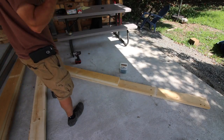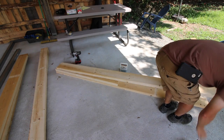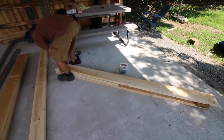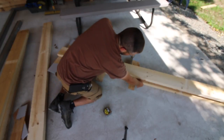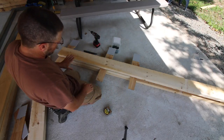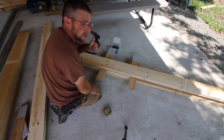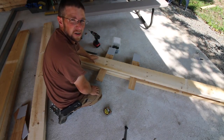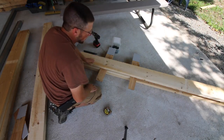Now that we got the first two screwed together, I'm gonna put the last one on top. I need a spacer — square everything up, flush it up. I had to shim these up. I want to make sure I have the right thickness in between here to get my glass panel to go through it. Now if they were all two inches thick, these 2x6s, it would have worked out perfectly — but being rough sawn, they're about inch and three-quarter from the mill that we got them from. So I had to make up just around a quarter of an inch thickness with some shingles.